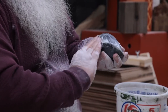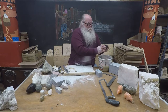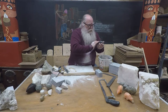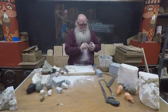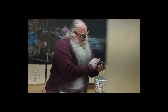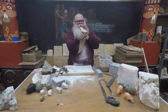We don't use any power tools to make these. All handwork. And this is my favorite part, when we're in the water, using the water. I think we're ready now to jump on into the final sandpaper, which in this case is 800 grit, wet and dry. Oh yeah, really nice. I'm going to dry this thing off. See if I can see any little scratches that I missed.